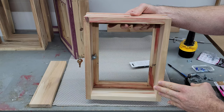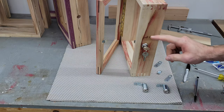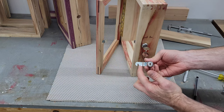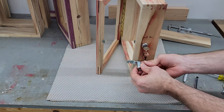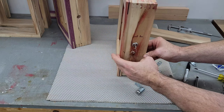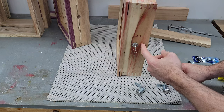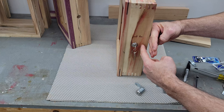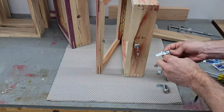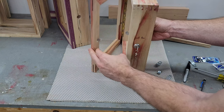Let's take a closer look at how to get the right measurements for this. The two measurements you really need to get right are where to drill the hole for the cylinder, and where to cut this latch so you have a hook that's not going to be too far out or too far in. Mine just happens to fall visually centered on the overall frame — that was just a coincidence. But if it were back any farther, it would have been inconvenient to use since the box is going to be mounted against the wall with only a tiny space to get your fingers in to unlock it. And if it went any farther forward, it would stick out beyond the front and prevent the door from closing all the way.